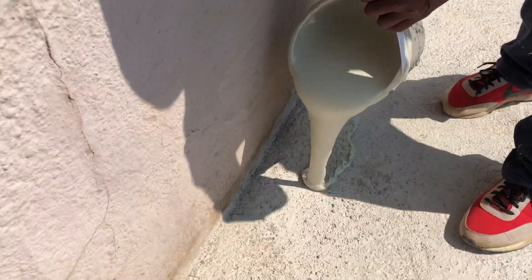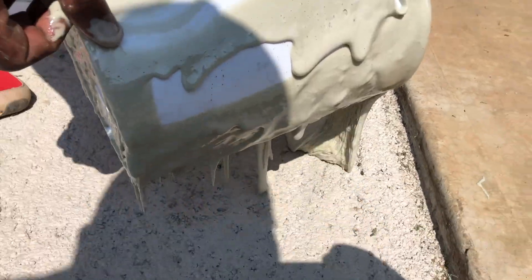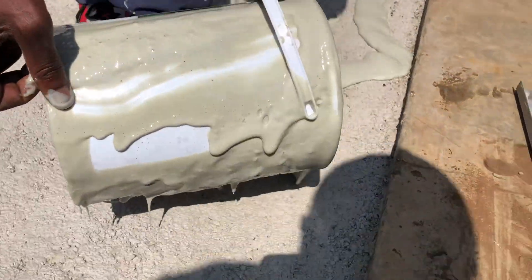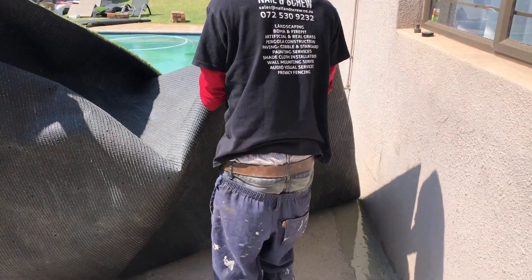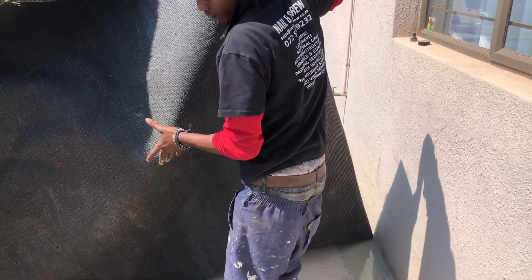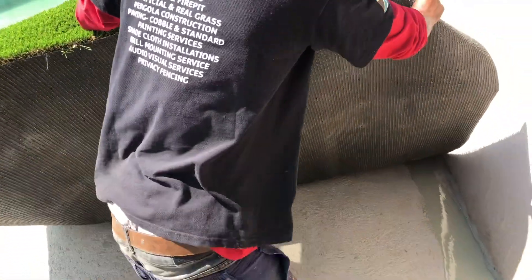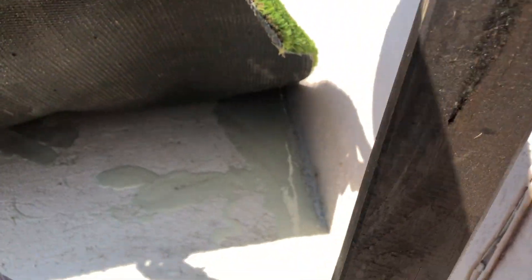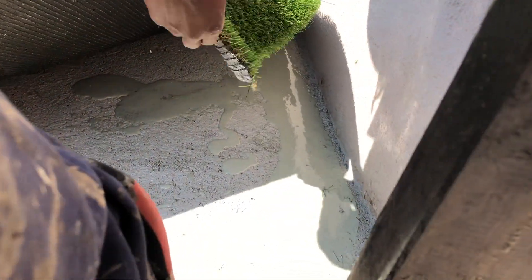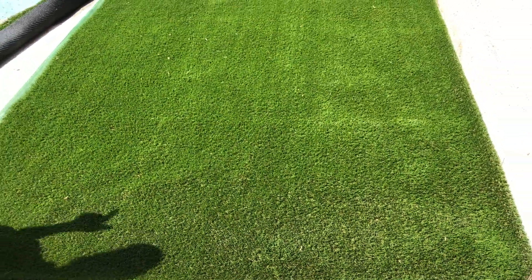The moment has finally arrived where we can install our artificial grass. With the area now clean, prepped and ready, we can lay down our glue mixture around the perimeter of each of our grassed areas. You can also snake some glue in the center, but the weight of the grass should hold it down and also allow water to drain through and underneath it towards the pool. Given that this is quite a long section, we broke it up into thirds — we applied the glue on the top third, then laid down our grass and made sure it was bedded in place, before rolling back the other two thirds to apply glue and lay down the rest of the grass.